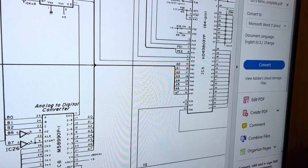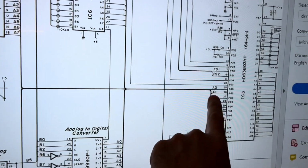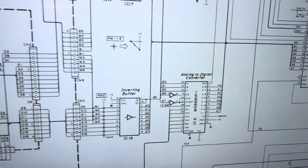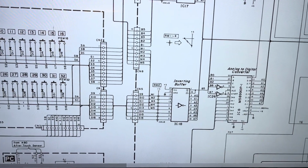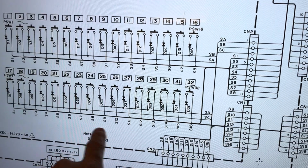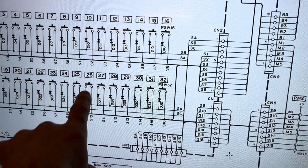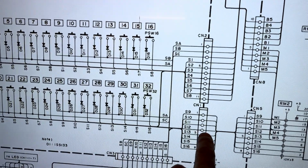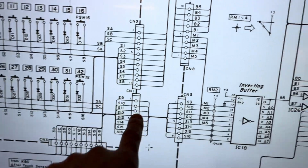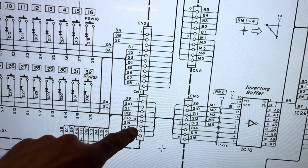In fact, because that happened to the other one, I would guess that something's going on in here. Actually, a broken track again, maybe. Who knows? Cannot assume, really. I'll check it now. So what I found was, I checked all these in this plug here, and for sure 28 S12 doesn't drop the voltage when you hold the button in. All the others do.